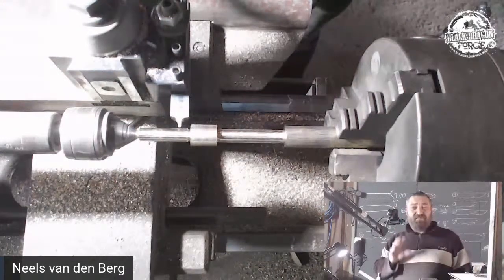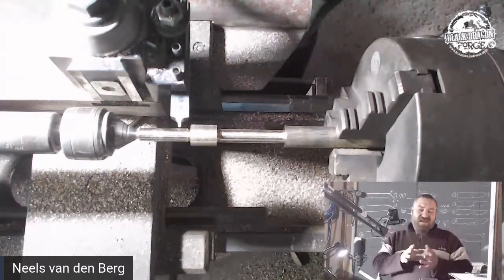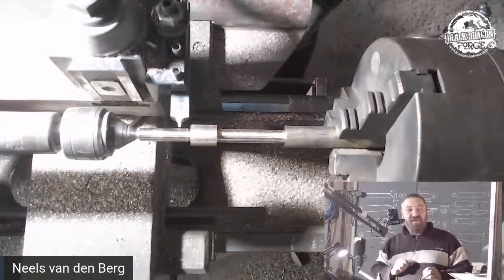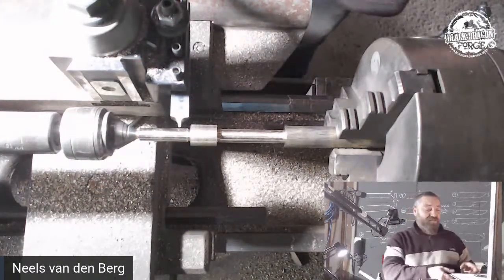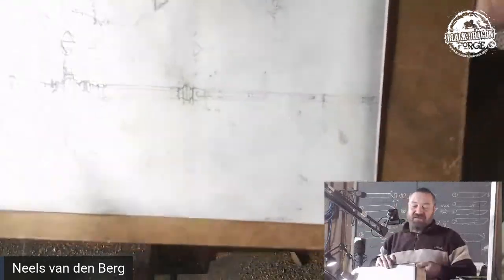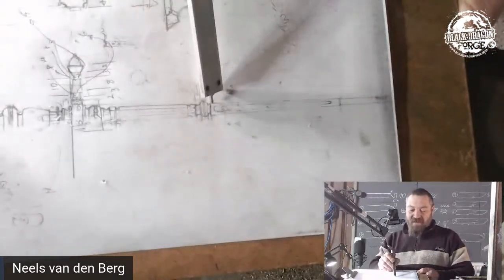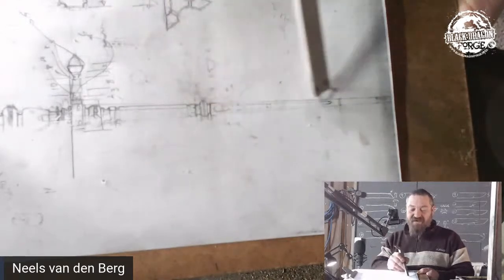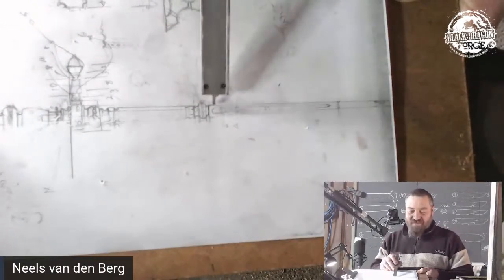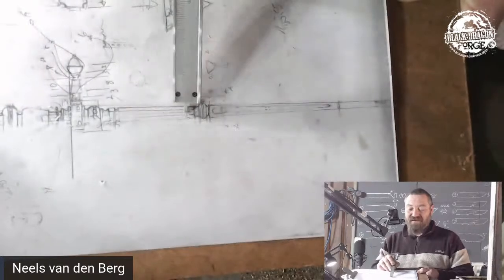Simple twist pattern. The bolder you can get it and the finer you can twist it, the better. In other words, a low layer count. If you can do like 12 layers and then twist it really fine, you'll get a nice little pattern. Keep in mind, we're now talking millimeters. On the triangle of the blade, where it turns into a triangle, if you've got a weird pattern up here, as soon as you get into the details down here, that pattern just completely gets lost. And it doesn't help having a funky pattern on this side and then nothing there.